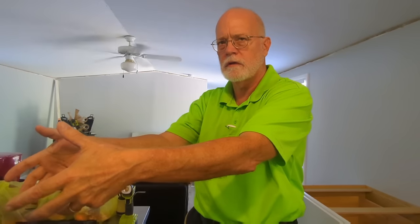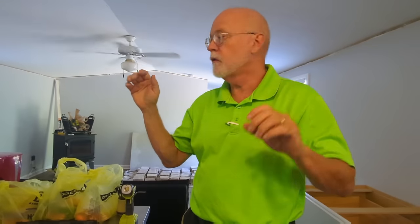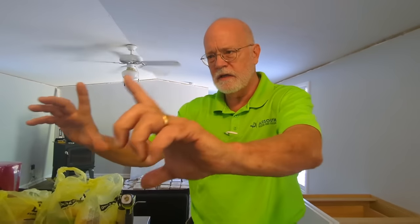This is one thing you might want to think about: the mini splits come in 2 configurations. You've got some that have multiple inside units and they all ride on 1 outside unit. Or you can have inside units that each have their own outside unit. So you have 3 inside units and 3 condensers. Now, I have found historically when I've priced those out that having the separate condenser for each inside mini split is a more economical solution. For you? Okay. Which is kind of opposite of what you might think. Yeah. But the shared condenser, I think because of the nature of it, is more costly, I suppose. Yes, sir.